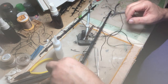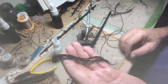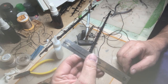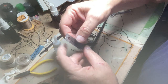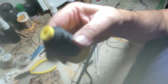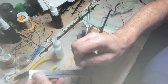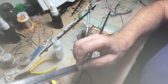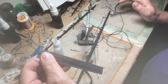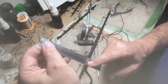And here I make a bunch of seizing strips, pre-make them, a lot of them. I take a ruler like this, put part of it through the hole, pin it down in the back, and then off my spool, I take that length, and I wrap it around here 50 times, okay? If I do that 50 times, that gives me 50 of these 6-inch strips off each side, so I have 100 of them. Now that may seem like a lot, but you're actually gonna use probably 400 or 500 of these little strips of black on your standing rigging